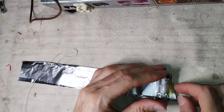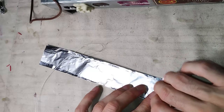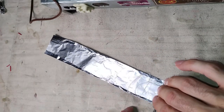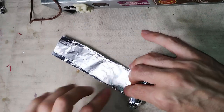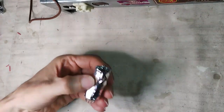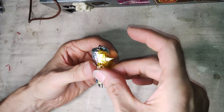This type of radio, like other CGE and Telefunken models of the same period, is not properly shielded in the RF section. It seems appropriate to try and shield, somehow, the mixer converter tube and the IF amplifier tube. Some aluminum foil is used, connected to the chassis with the help of a tinned copper wire.